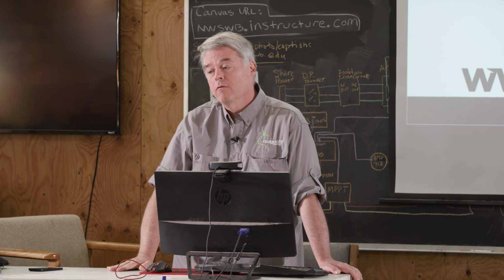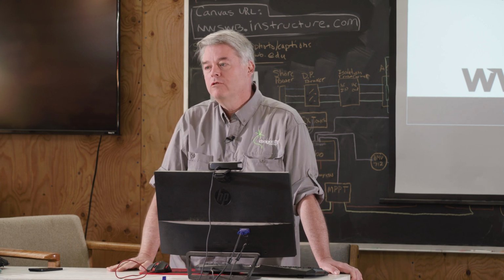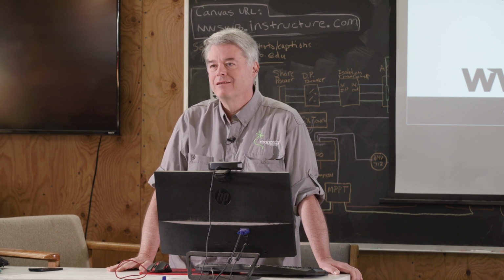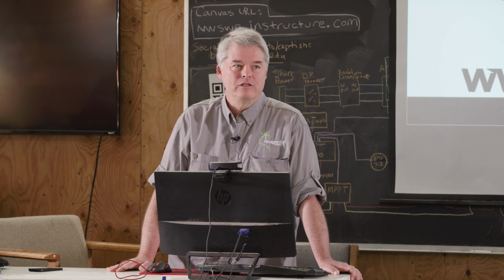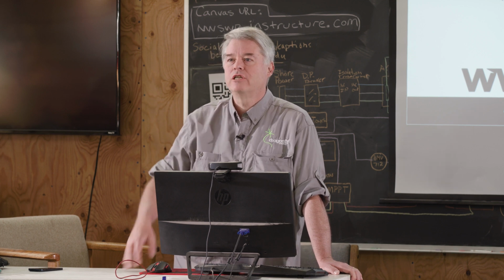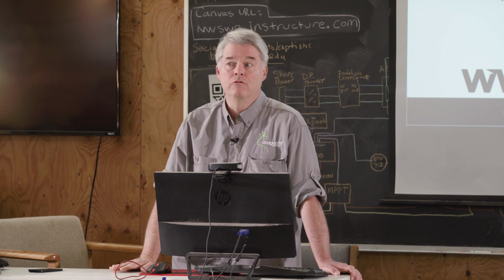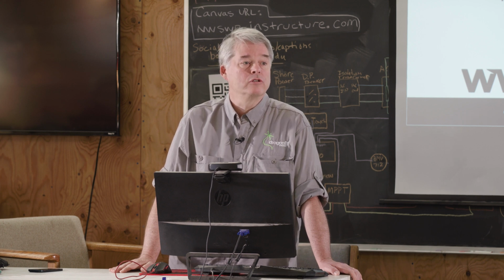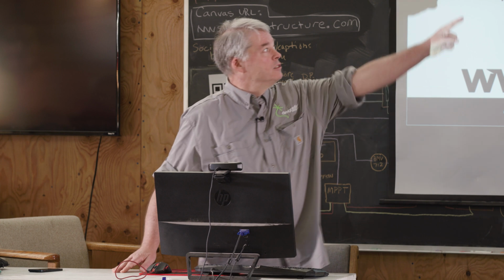But when you look at how things were done 40, 50 years ago, and fuel cost 20 cents a gallon, nobody really cared, right? But fuel ain't 20 cents a gallon now. And that's just one aspect that makes a 50, 60-year-old architecture less desirable, the fuel efficiency. An AC generator is going to burn, I'll bet, 2 to 2.5 times more fuel than a comparable DC generator system would, hands down, just because of this.